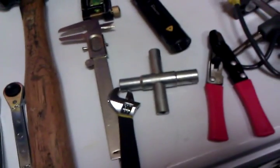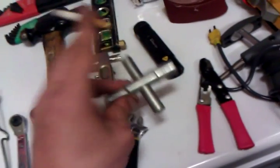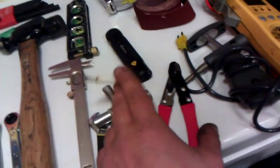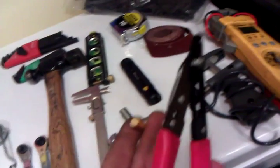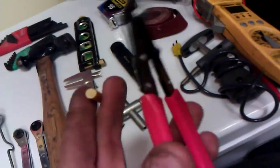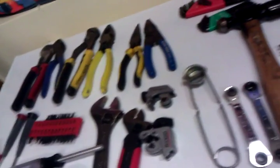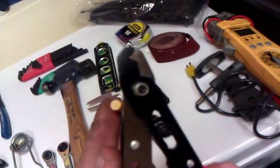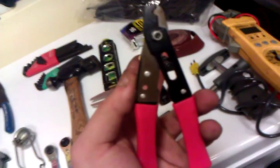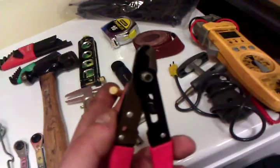A four-way water valve in case you're working on a unit and you've got to clean coils and there's a water spigot but no gate valve on it — something very, very handy to have. One of my favorite tools is a capillary tube cutter. When you're putting a new cap tube in, you've got to cut it to length. Unlike other people who use their lineman pliers or wire strippers — which collapse the end of the capillary tube — this one I bought at my local Johnstone cuts it perfectly with no collapse.